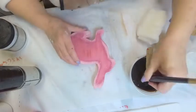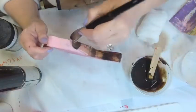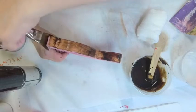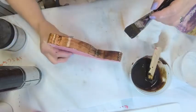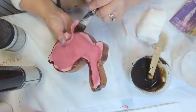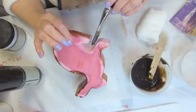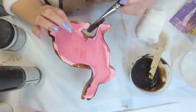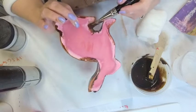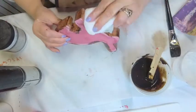We're going to start on the sides. Before anybody asks: can you glaze over wax? No, not over true wax. True wax — solvent-borne, like beeswax — is the final coat. It is a water-resistant top coat. The reason it was used for so long is very simple: it was the top coat they had before other top coats existed. It sealed up the wood and protected it against moisture. So if you're going to put something water-based or even solvent-based over wax, it's going to resist it and you're not going to be happy.